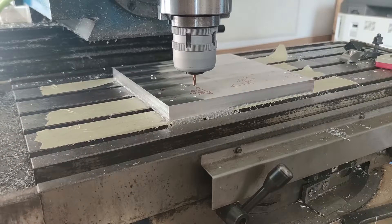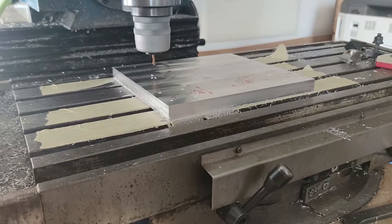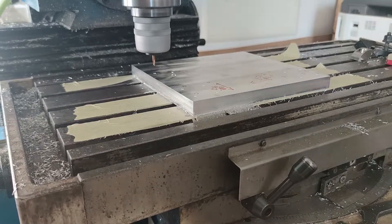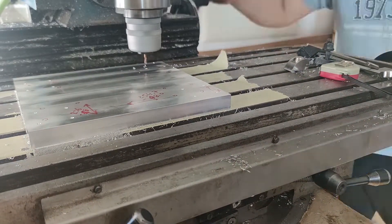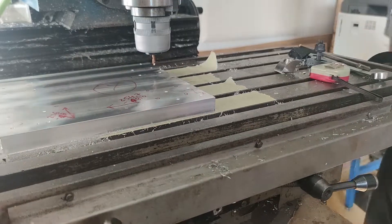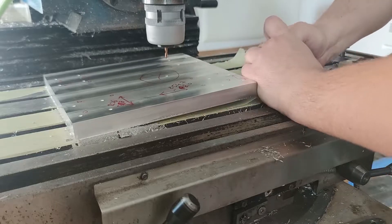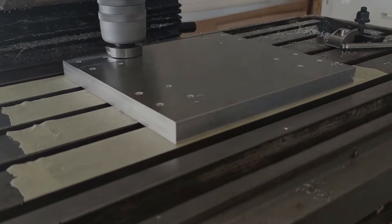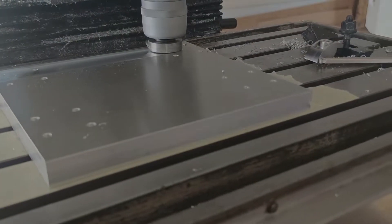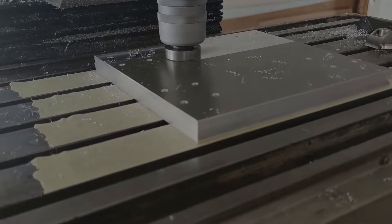All the dimensions were very critical for the next operation. I decided to spot all the holes for mounting with a spot drill. The holes were for attaching the blocks for the linear rail. Then I pried the part from the table with an allen key and the glue eventually gave up. I then drilled the holes on the drill press and repeated the superglue process for the other side, because the clamps would be in the way on the top surface.